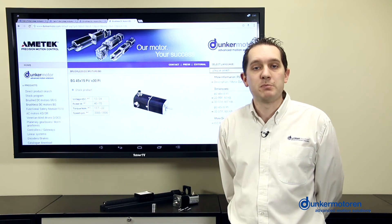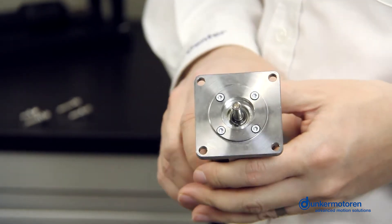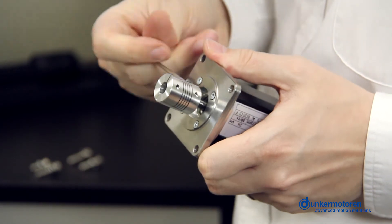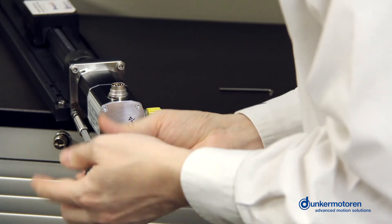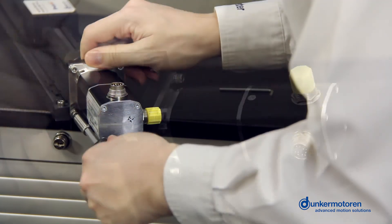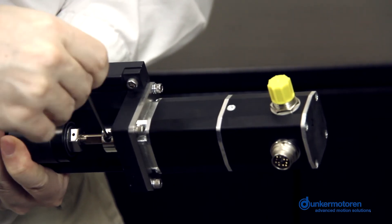The hookup is extremely simple: four screws to connect the flange to the motor, which can be ordered assembled from our eShop, and then set screws to attach the coupling to the motor shaft. We then locate the flange to the mounting of the RGW10 and secure with four bolts. Finally, securing the coupling to the RGW shaft with another set screw.